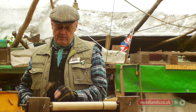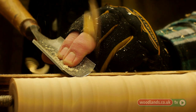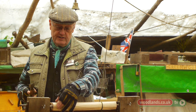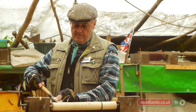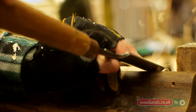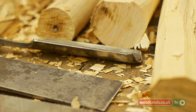We've got the roughing gouge here — we're going to continue the rounding process with the piece of wood. You can see the wood's coming off. Working our way along, and we've got the high points. Even with the rounding process there's still high points on the wood. We've got the shape that we need. What I need to do now is to use the smoothing chisel to smooth it off and continue the shaping process.